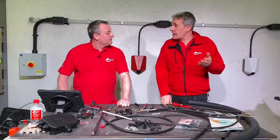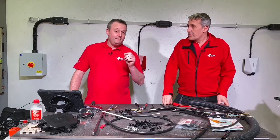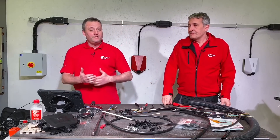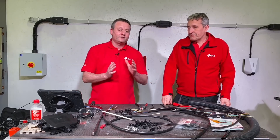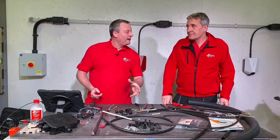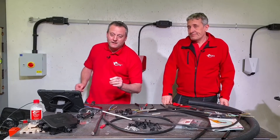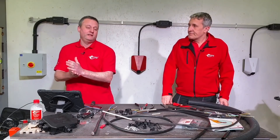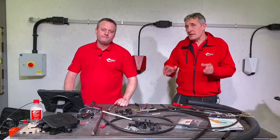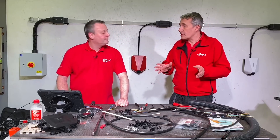NYY will typically have PVC insulation — thermoplastic PVC — with a maximum operating temperature of 70°C. Tough sheath, manufactured to the same standard as armored cable, uses cross-linked polyethylene (XLPE), which is a thermosetting material with a 90°C maximum operating temperature, meaning it can carry more current for the same cable size.